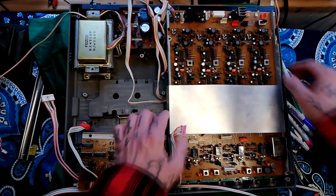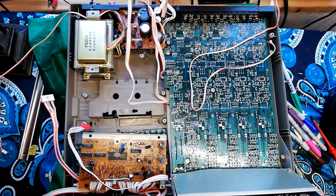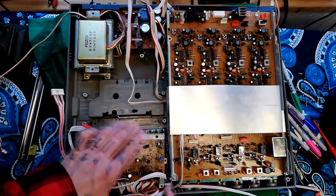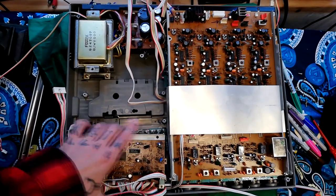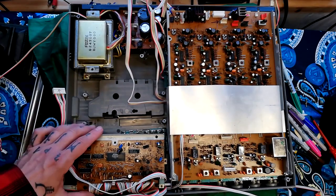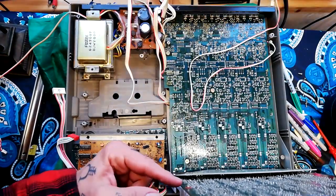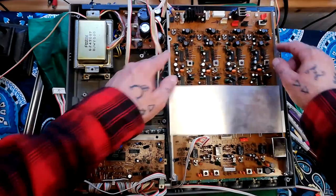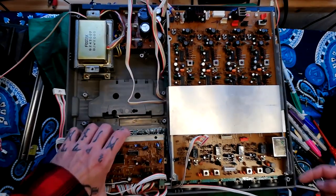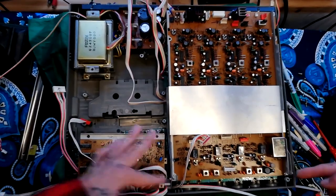In order to get this out, I've removed two screws here and then it tips like that. But that hinge mechanism is based on two screws here and I can't really get them out without removing all the control panel and everything — and I'd like to be able to clean those switches anyway. There are six screws that attach that board to these hinges. I think it's less labor intensive to remove this, clean it, and then remove those two screws at the side there that I'm pointing to.